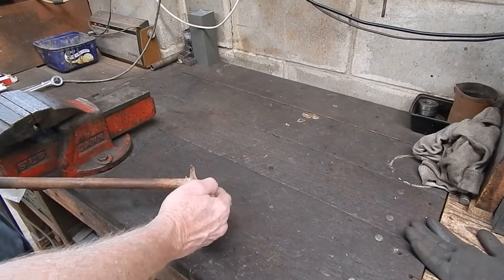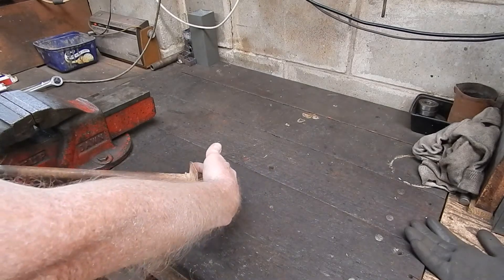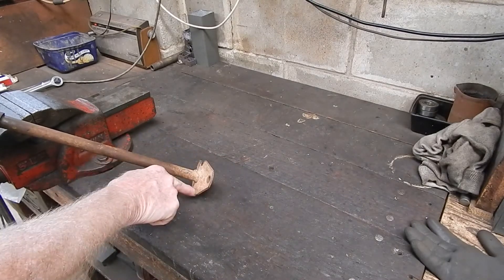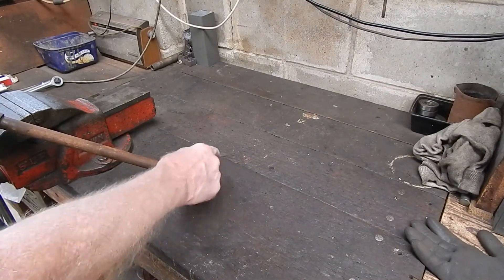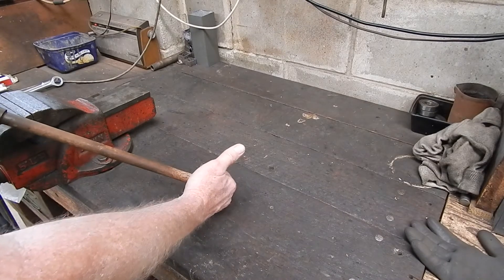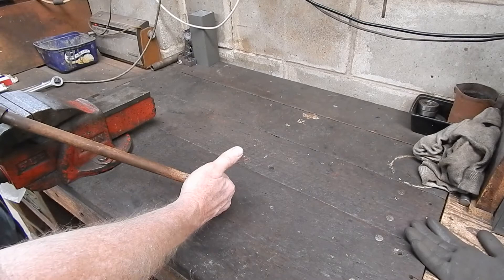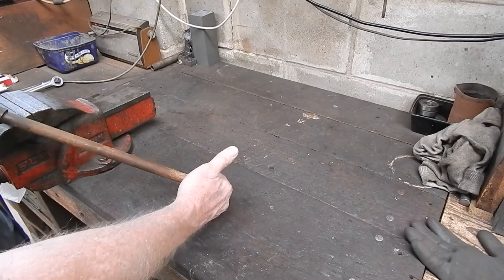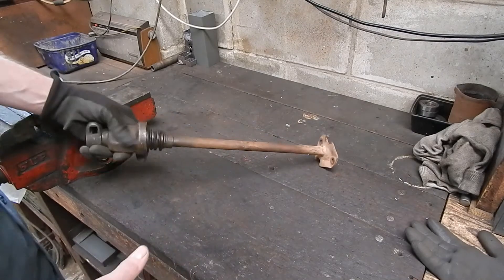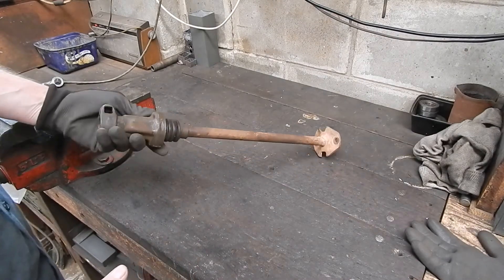This one would have had a pin-type coupling down the bottom where a facing plate comes up against it, with two pins coming through and a composition disc between them. They're a type of universal joint but they don't give you a lot of movement. You could at a pinch use that section, but this is the best way to use it.